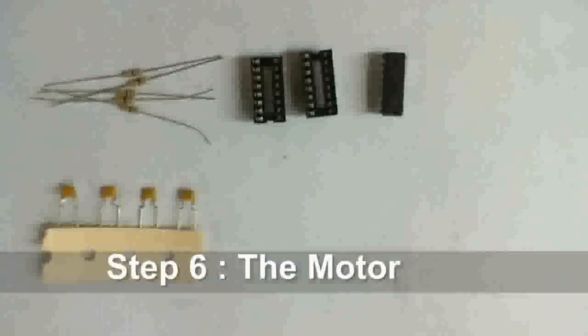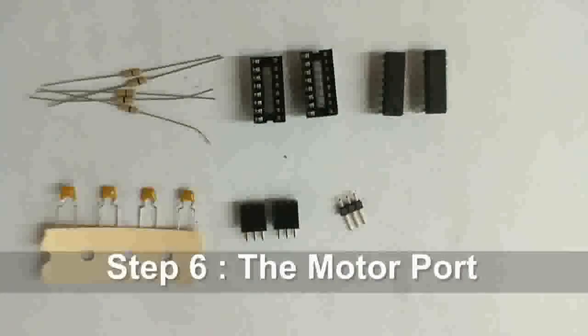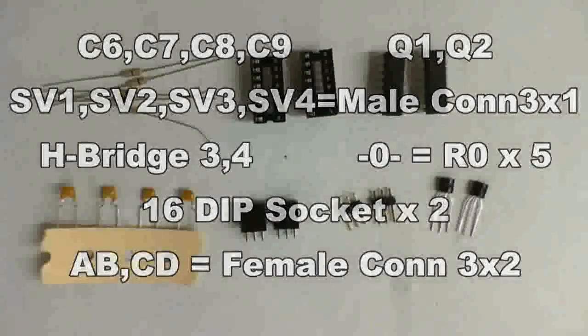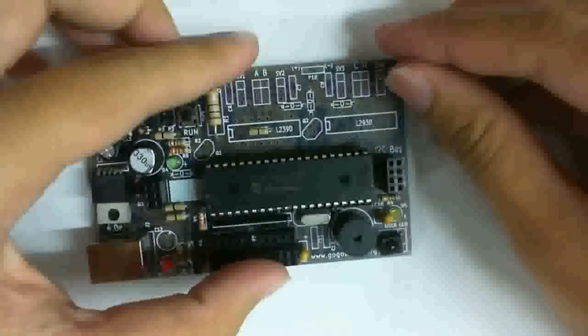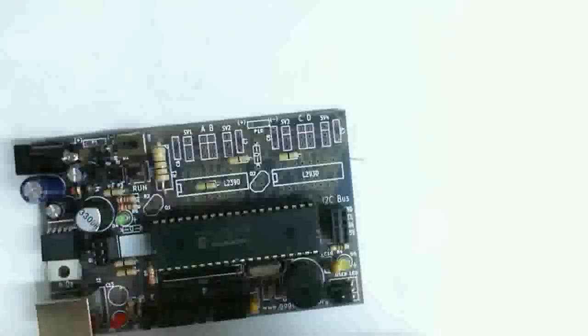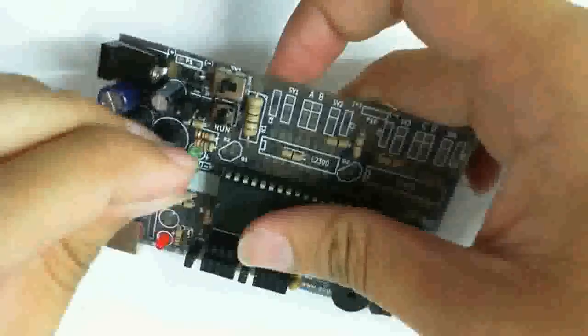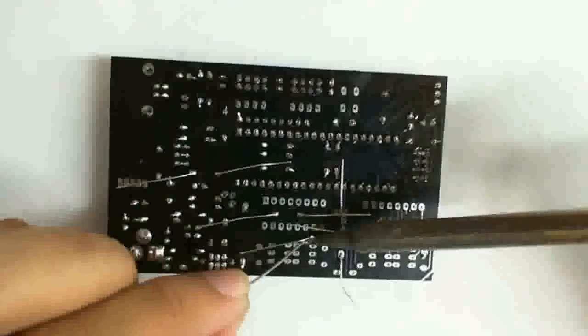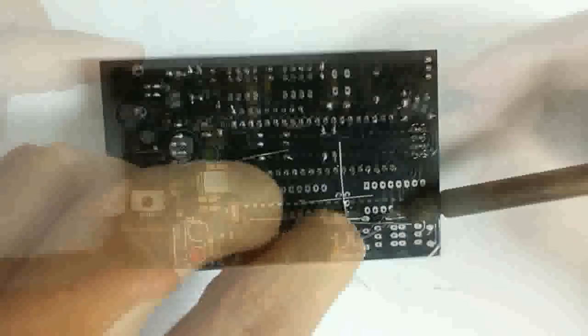The last component that we need to assemble is the motor ports. The parts that we need are on the screen — please refer to the bill of materials for further information. The components will go onto the only vacant part on the PCB, which is the upper right part. The process is pretty much the same: you put in the components into the right position as you've done before in the previous steps, and then just solder everything neatly. After you've installed all the parts, including the motor driver chips, it's time to do a small test.